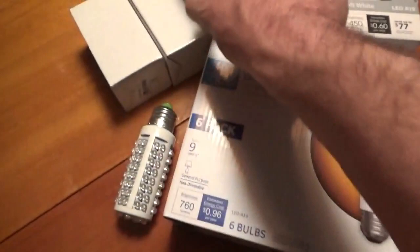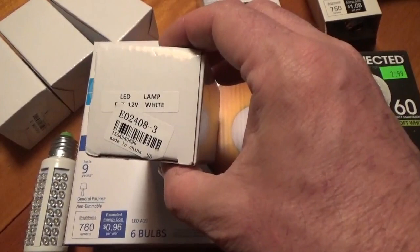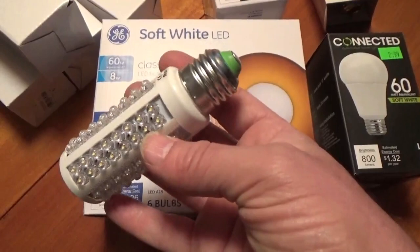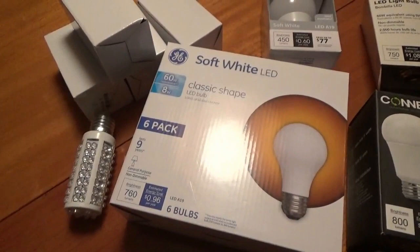I'm not sure about these - I'd have to open one up. Oh, these are 12 volts, so we can't use these. Good thing I checked that - those are 12-volt LED light bulb replacements. I do believe this one was an AC 110-volt screw-in bulb with the normal standard socket that I bought long ago back in my motor home days.